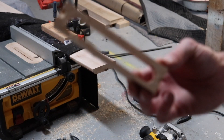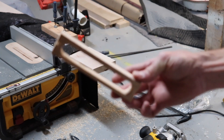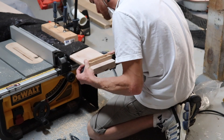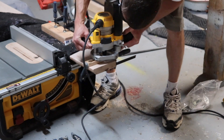I'm using a jig that I made out of 3 quarter inch plywood, a piece of scrap I had laying around. I used a 3 quarter inch straight cut bit on my router to make it. I made it 6 inches wide — the exact width of my frame rails — so that I can clamp it into place.